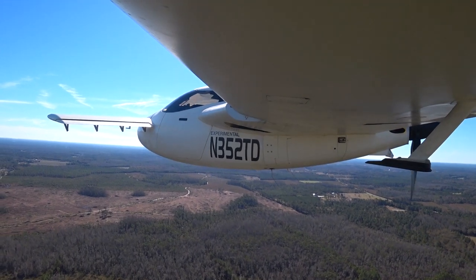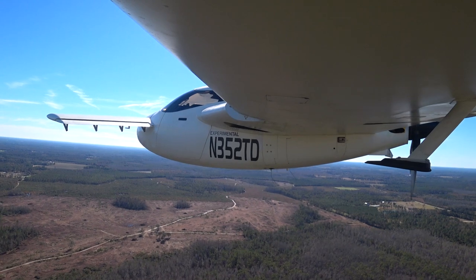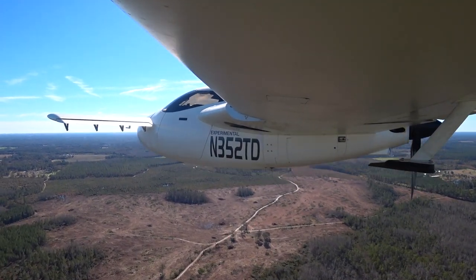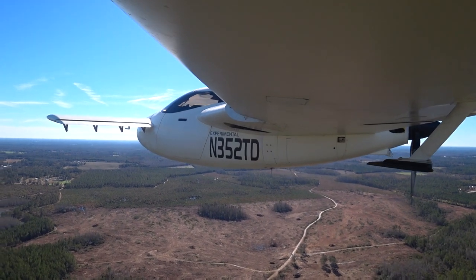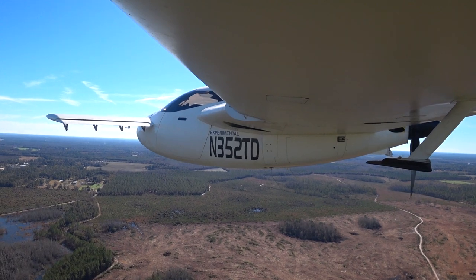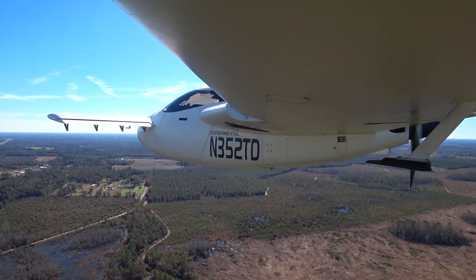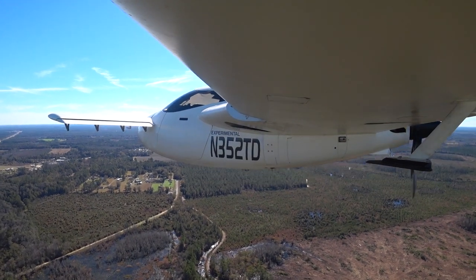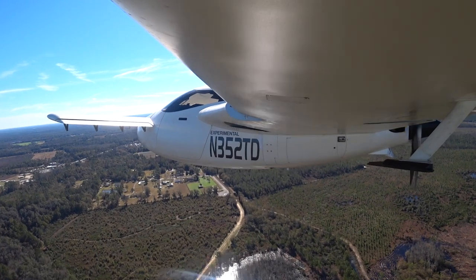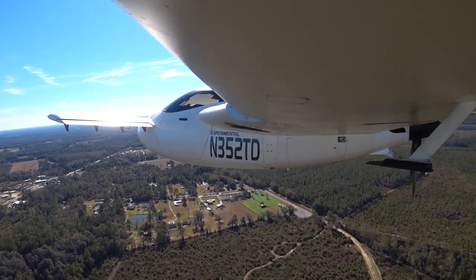But for now, just for testing going forward, I think what I'm going to do is hit the governor a tiny little bit so it'll keep the engine under 3,800 RPM. And then, of course, right after takeoff, once I'm climbing out, immediately keep dropping it back, which you'll see in yesterday's flight, which was much better performing. But anyway, that's the takeaway from this particular flight.